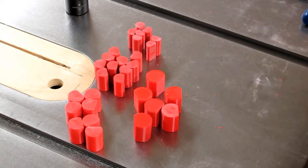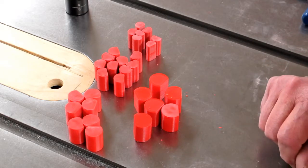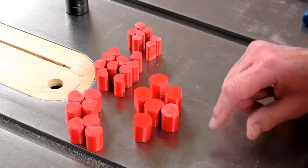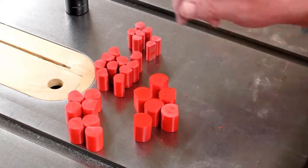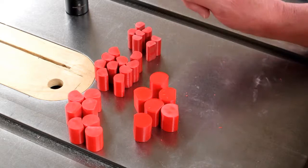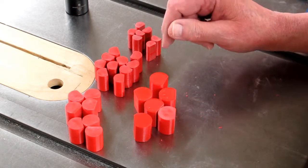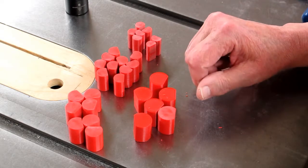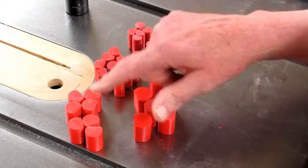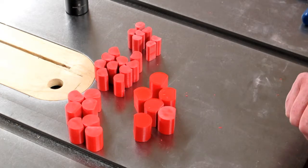Printing all of this took about 40 hours, plus the time to prototype and get the fit correct for each pipe. The inside diameter of the pipe is irregular to some extent, so it takes a while to zero in on what size they should be. These were originally called out to be made out of wood dowel, but printing on the 3D printer is a lot more accurate and consistent. I doubt I would get that consistency with today's wood dowel.